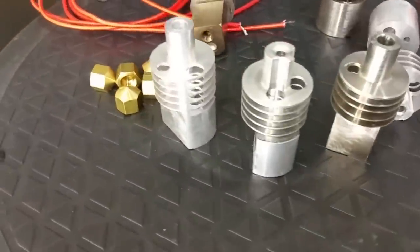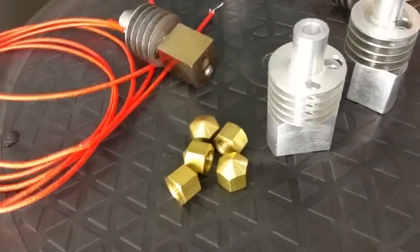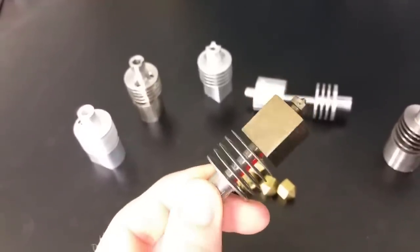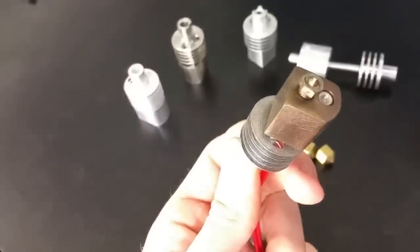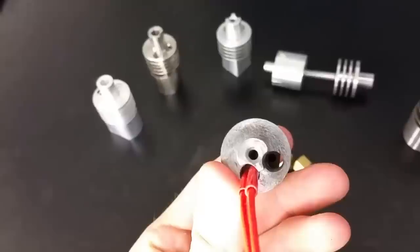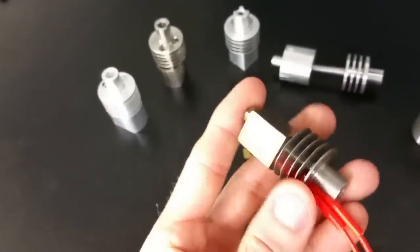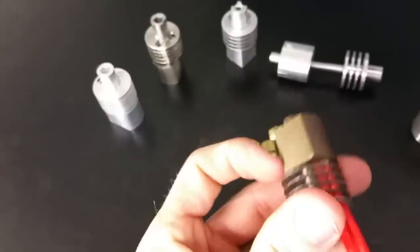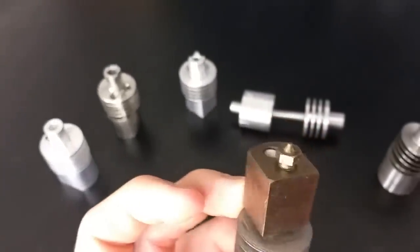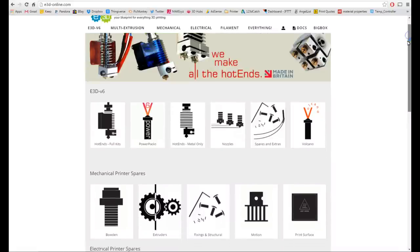I started all over again, but this time working with some very smart manufacturing engineers to come up with the ultimate high performance but low cost hot end. And despite my best efforts, it turned out to be almost exactly the same as what E3D had done — an aluminum heat sink with a stainless steel heat break going into an aluminum heater block. The experience I gained working on my hyper hot end gave me a proper respect and understanding as to what makes a good hot end. When I go on to talk about E3D, you know I'm not just jumping on a bandwagon. I tried my best to throw mud in their face, but I came out of this with a deep respect for what they have come up with.